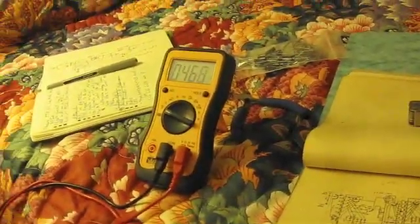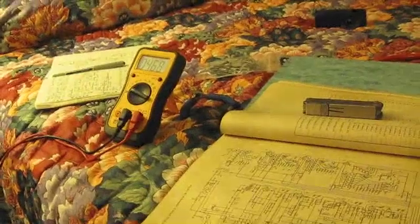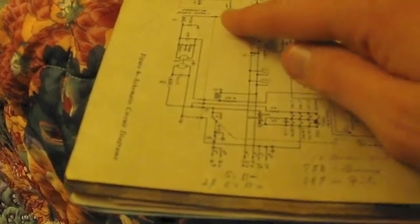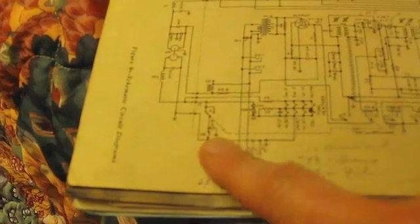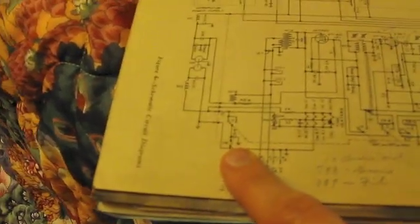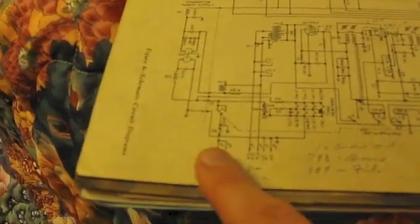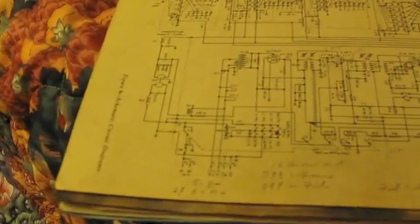Let's watch the meter climb. Well, that didn't take long — it's already at 466. The tube is up, filaments are lit. So that's about right. This guy hacked this thing — we found fuse FU23 in here, and it turns out it goes to the dynamotor which takes 14 volts. He took this connection and ran it right to the other end of the fuse, removing the fuse. We're going to do a continuity test between pins 3 and 4 and ground to check if anything's shorted, then power up the radio itself.